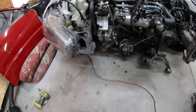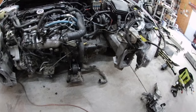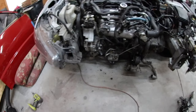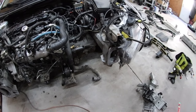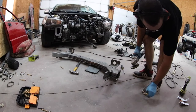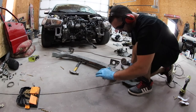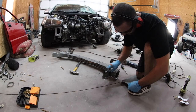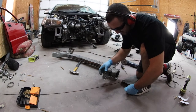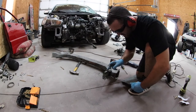It was really easy in comparison to prep this one and get rid of all the old sheet metal we didn't need. But now we've got to do it on the car, and it's a bit more difficult. I don't want to pull the motor just to prep this thing. This side won't be too bad, but this side might be a little more difficult with the alternator right there. I'm hoping I don't have to pull the headlights off. At the end of the day I want to get this thing fixed and ready to sell as fast as possible — it doesn't matter how much money you make if it takes you 10 years to do it. When you're prepping the material, you don't need to push into it hard — all I want to do is remove the paint on any surface that's going to get welded, front side and back side, because when you weld it the weld will bleed through and I don't want contaminants. Don't grind into it — it's like 18 or 20 gauge, you just want to get the paint off and clean up the edges from where it was drilled out.